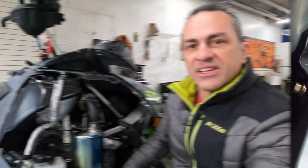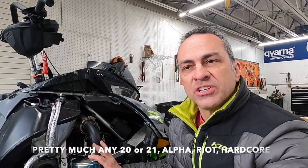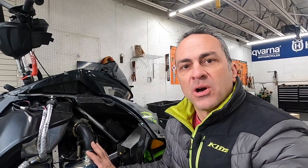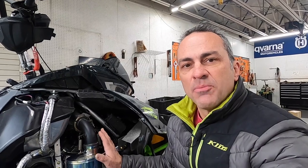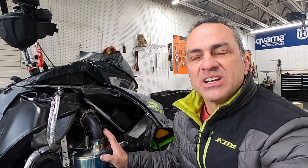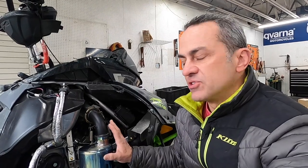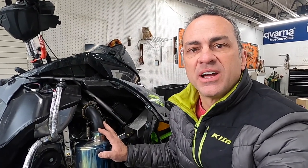So that's our little fix for this, the Arctic Cat Alpha. Like I said, when I look back through the microfiche, it looked like they started putting this new servo motor with the new servo motor pulley on it sometime in 2020, because some of the part numbers are the old part number, and some are this new part number. So if you have one of these sleds, go back and see which one you have. It's super simple to put that washer on to keep you from having a breakdown on the trail. If your power valve cables come off while you're riding, it can cause a pretty big running problem. You're just not going to be able to build the RPMs or have the mid-range that you had before. You're really going to notice. This guy really noticed that there was a big problem on his sled when they popped off during his ride before he brought it in.